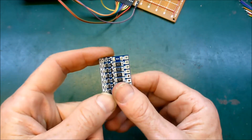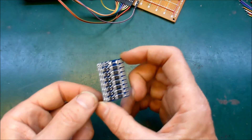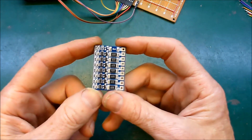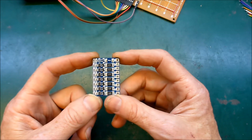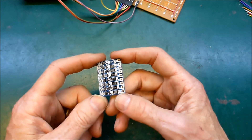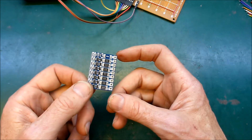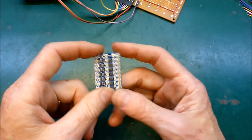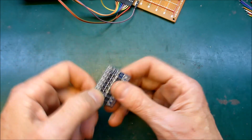This costs $5 USD. I just bought it out of curiosity mostly. I'm going to wire this up to some balance leads so that I can plug it into one of my 1kWh packs, and then see what, if any, effect it has on the balancing — whether 50mA is going to take forever to balance or is just too wimpy. This would be ideal for a half-kWh pack; that would be more appropriate for something of this size.